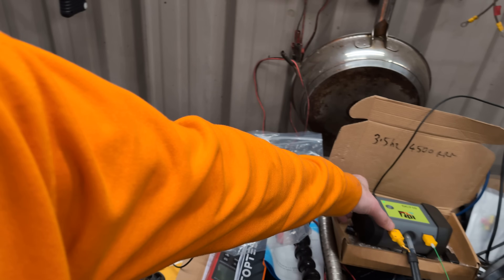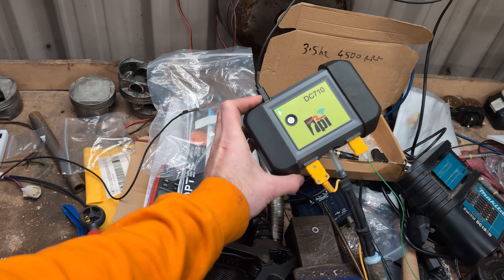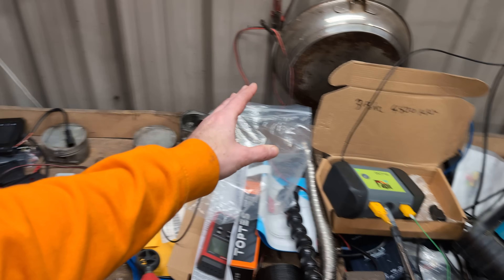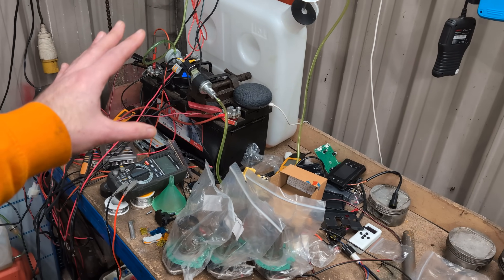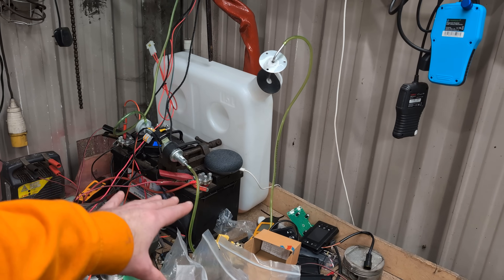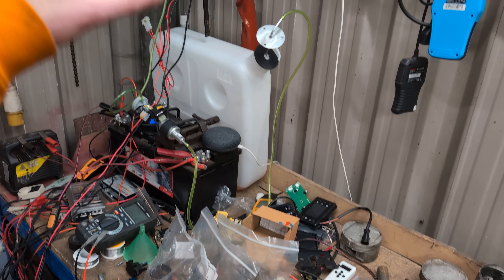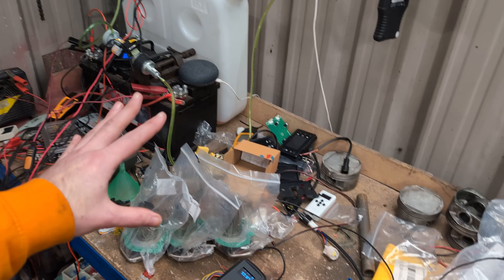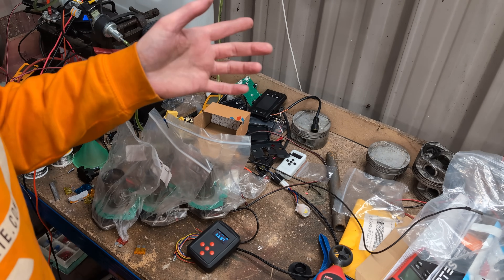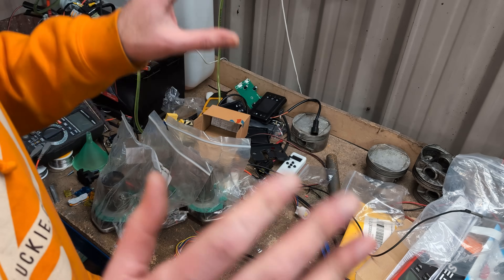I've also got the TPI DC 710. The exhaust is outside, so I'll run that outside and then obviously it's wireless so I can come back in and tune it while that's outside. The plan is we'll put the waste engine oil in there, run it, tune it, and then let it run until it uses about half a tank of fuel. Then we'll take the diesel heater apart and see what the insides are like. So for the first test we're going to take waste engine oil out of the Hilux and filter it — that is all. Just filtered, then we'll put it in.